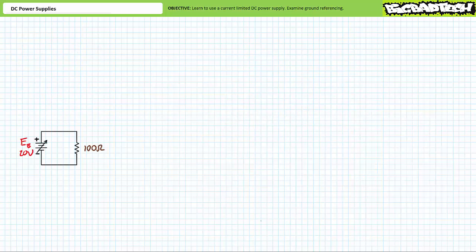also forming a closed electrical circuit consisting of a 100 ohm resistor capable of handling up to 2 watts of power. An application of Ohm's law demonstrates that we should expect 200 milliamperes of current. A subsequent application of the power equation demonstrates the resistor will consume 4 watts of power. You'll note that we'll be overloading this particular resistor by twice its rated power of 2 watts. It should handle it, but not for long. We might expect this resistor to heat up and smoke a bit.